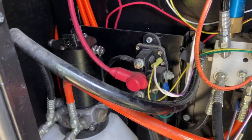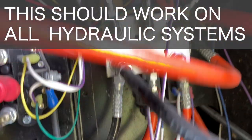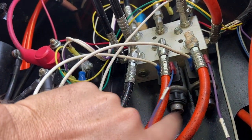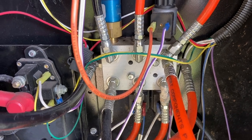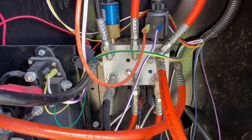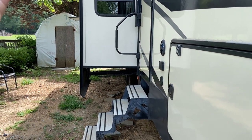So if your drill didn't work on top of the LCI motor, we're going to talk about this manifold right here. You can see these little Allen wrench holes on each one of these — there should be one of those. Here's another one right here, and right here. This is a little bit more challenging because some RVs don't have these labeled, as this one does not — this is my in-law's fifth wheel. So we need to figure out which one of these is related to the slide that is not operating, and we could do that with some trial and error. We take an Allen wrench and we need to open up this valve, or this valve, or this valve, or this valve until the room is able to be pushed in.